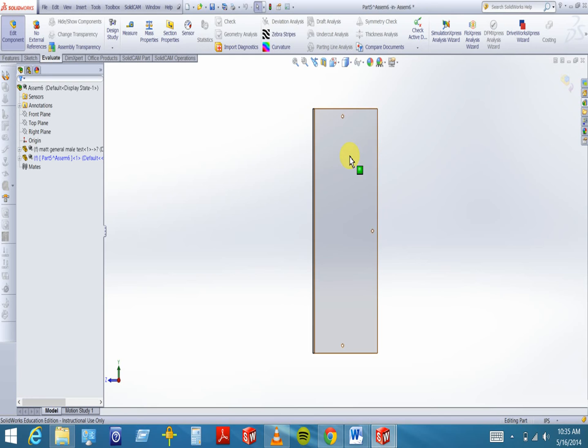Okay. So we're going to build our new part off of this part. Remember, the design intent is, hey, I'm going to build this part and sketch it out, and then it's going to refer to the male always. So think about that as we're doing design intent. But we still have to build a part. It's still this female U-shaped box, right? So we have to build a sheet metal part, and we're going to build that sheet metal part the exact same way we built this male sheet metal part, which you learned in your tutorial yesterday. We have to start with a sketch that will then become our base flange, and then we'll bend up the edges around that, right?